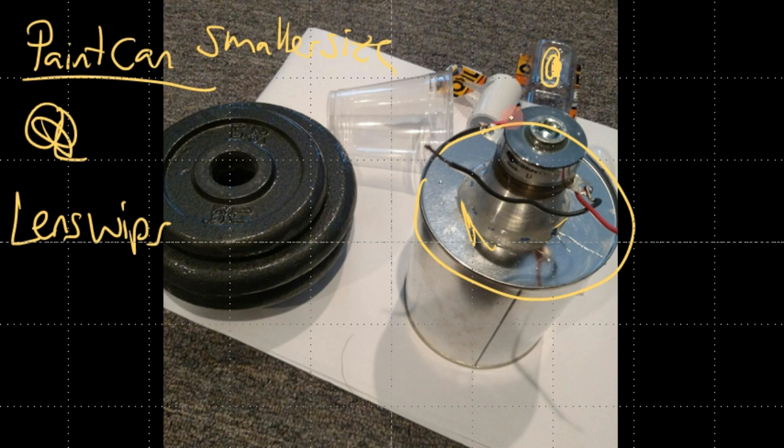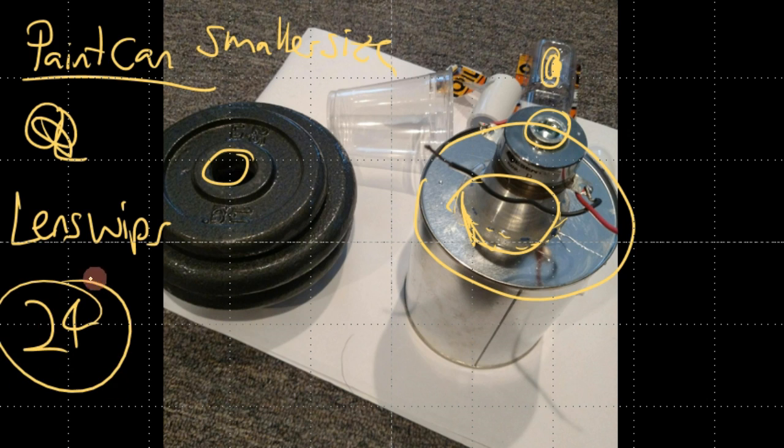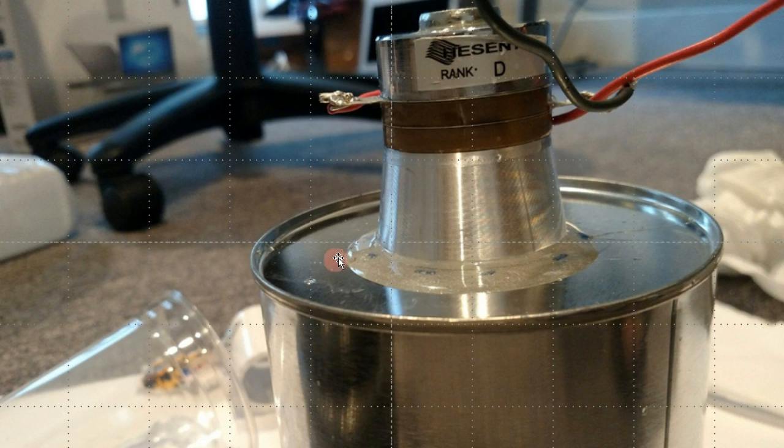I mixed the epoxy; the box comes with a little area to mix it. I applied the epoxy to the paint can in a specified area that I had dotted in blue with a dry-erase marker, and spread it out there — without applying any epoxy to the transducer to begin with. Then I put the transducer on; it was sort of sliding around so you have to hold it in place — remember this is 5-minute epoxy. I put all these concentric weights on top, held the transducer in place so it didn't shift, then let it go. You have to wait 24 hours for it to fully cure, and then the transducer is nicely epoxied, with the weight left on overnight.